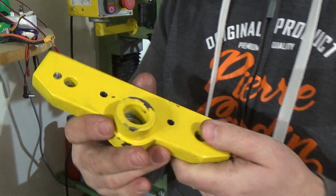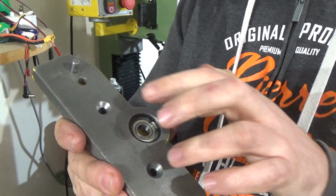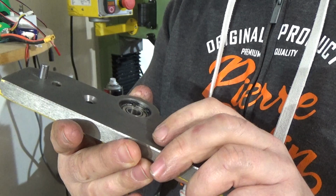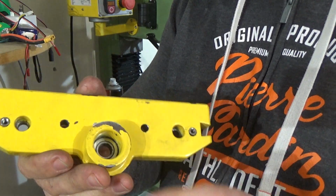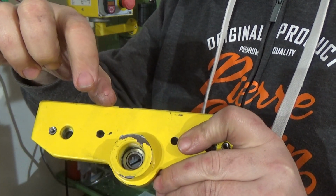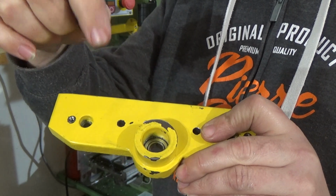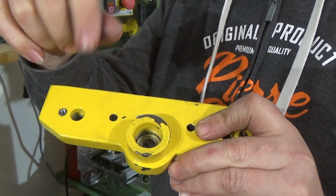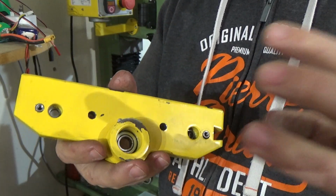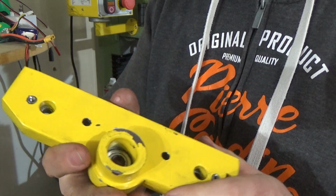Okay, so that's the bolt holes drilled, just drilled straight through, countersunk for our M6 countersunk bolts, or set screws, whatever you want to call them. Possibly just going to do M6 bolts through, a threaded boss, I think it's got to be 71mm long, and then like a bar, possibly a couple of grub screws in that to hold it. The parts on the motor are threaded but sleeved out. I don't know, it'd be easier to show you.